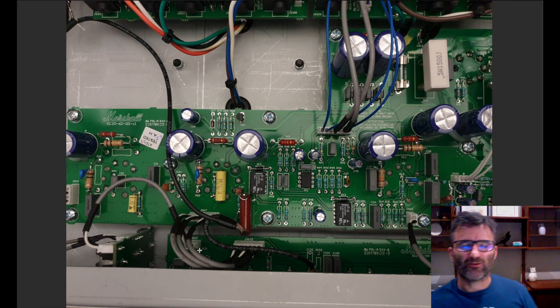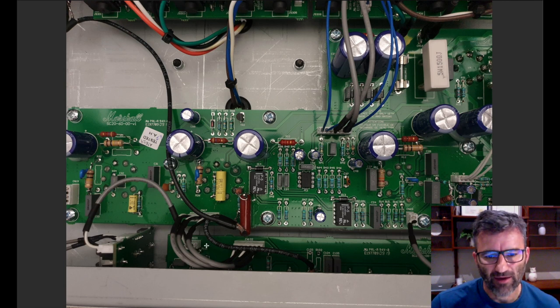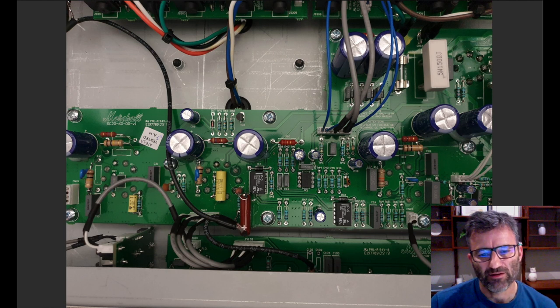And here's just a top-down view. It's kind of zoomed out a bit, right? So you can kind of see how this is sitting in here. And you can see the two coax lines. Here's the one that goes over to the switch. And here's the other one that goes over to C103 and R102 to get the guitar signal into the tone stack, and off it goes.